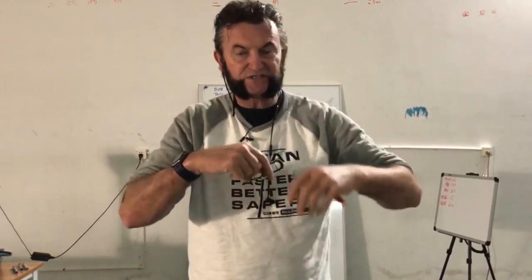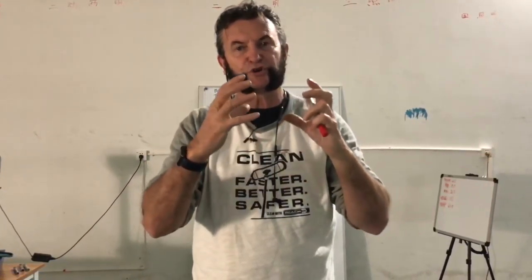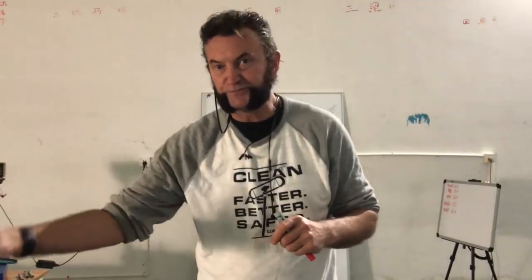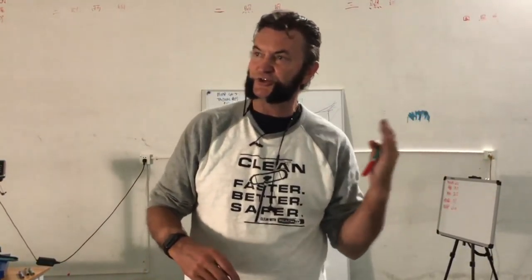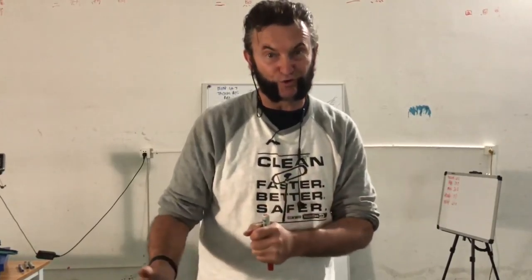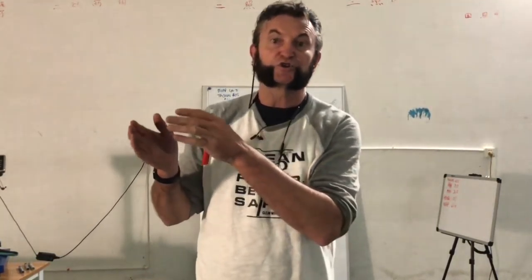We flex test every single pole after assembly, and every pole has a small range, as you can see now. We don't use 13 pounds, we use around 12 pounds, and then we flex test every pole, and if they flex too much, we reject them. So we can put a flex guarantee on each pole style. If you want us to sign, put a specific number or your name on it and ship it to you, you can run exactly the same test and we'll guarantee that the pole you thought you bought from Reach It from our marketing is the pole that you actually received.